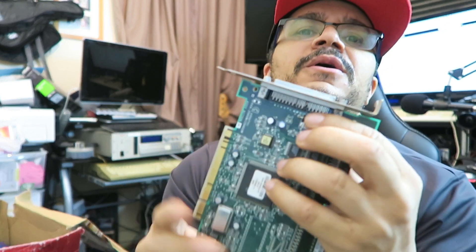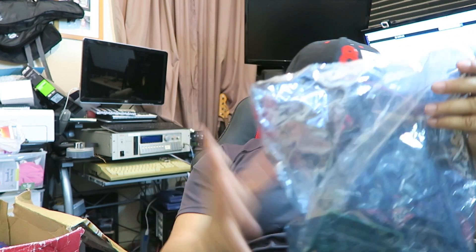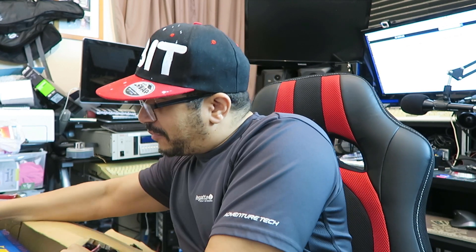This is the SCSI card I ordered from eBay — it's the right connection but somebody has damaged it. It's loose and the pins are a bit iffy. I could try to unbend them but I'm not going to plug it into my Akai until I know it's 100% working, because the Akai has a SCSI fuse in it and if you blow that, I've read on forums it's a proper nightmare to get sorted — and I'm no Akai motherboard expert.